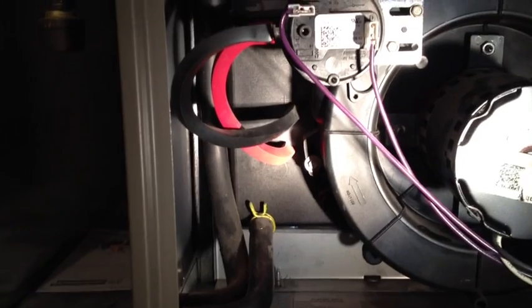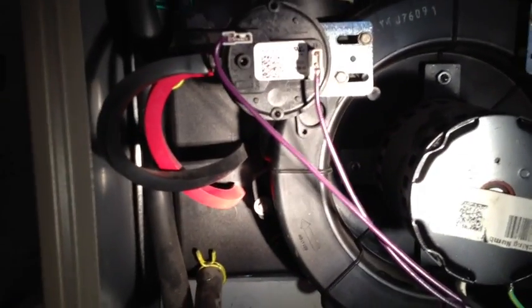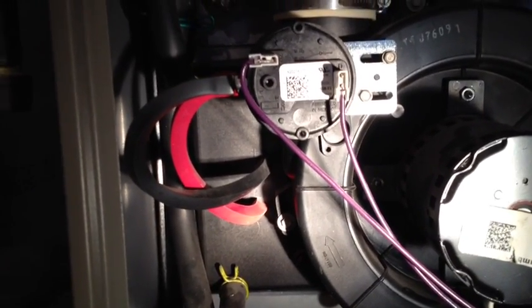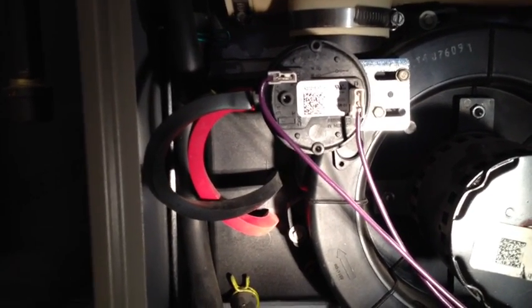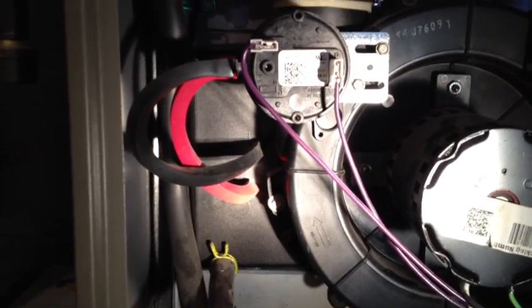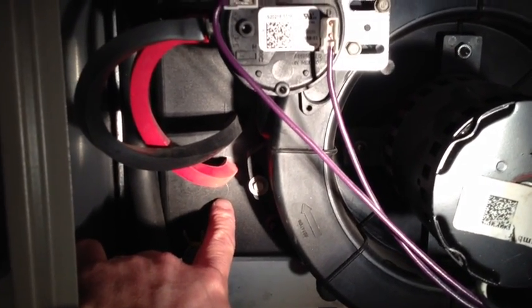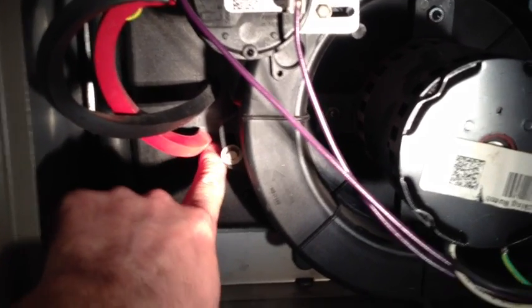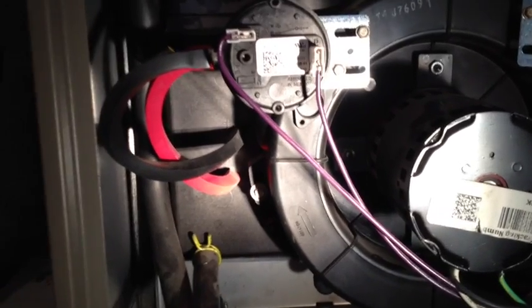And this is actually what the problem with my furnace shutting down was, so this one might be helpful to you as well. This does not have anything to do with the flame sensor. It's a totally different issue. So if you've tried the flame sensor and you could not get the furnace to ignite and run consistently, then you might want to check this out. Apparently Lennox had a problem with this. The black unit back here is the condenser unit, and they had a problem with the port behind this hose clogging up with some ash or some mineral sediment or something to that effect.